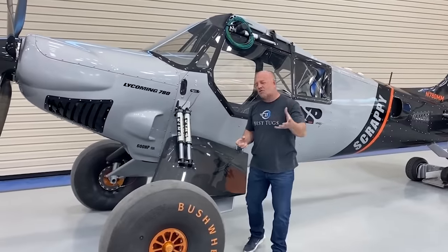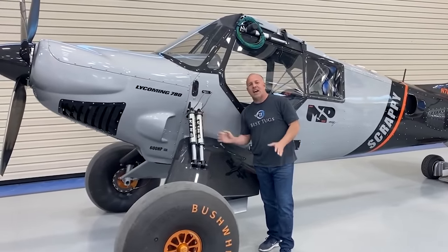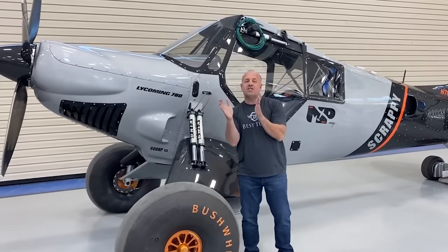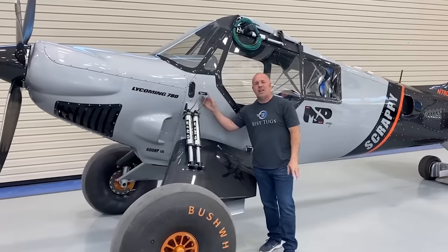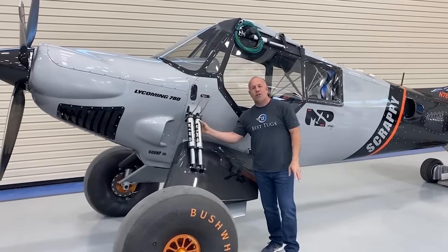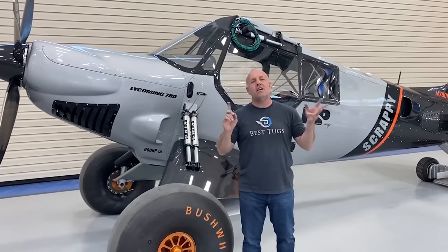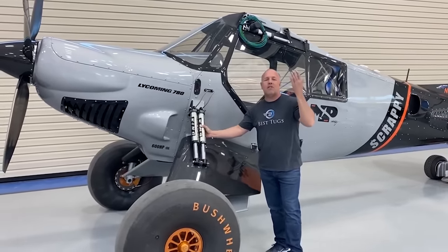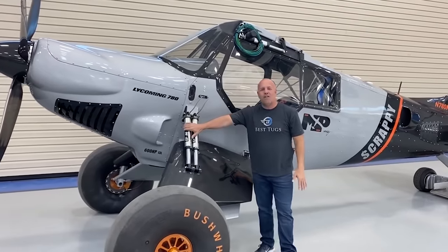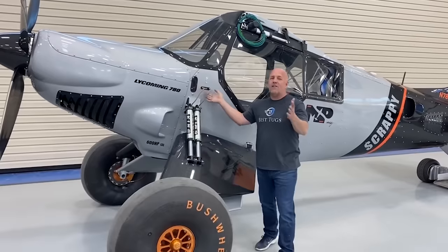So what's great is I worked with King and we added a second device inside to separate the oil chamber from the air chamber so that this can run indefinitely up and down and not mix the air with the oil. And I still have full damping control, full adjustability, valving, the shim spacer adjustment in it for rebound and compression. I have all the functions of King with a fully air ride integrated to the new valving system I created.